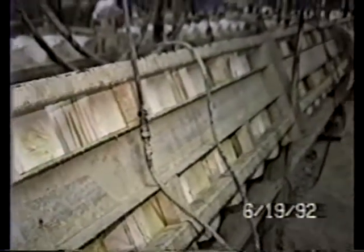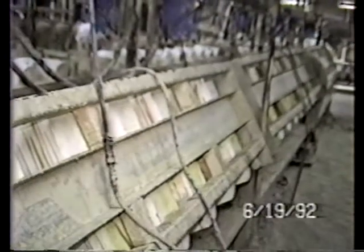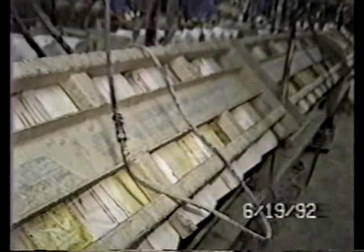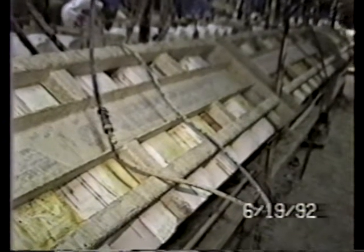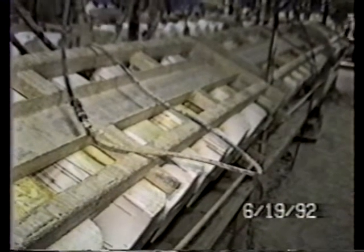turns. There we go. Now it'll tilt towards the inside. The reason it tilts gradually is so that the volume of liquid being discharged on the belt is maintained at a controllable rate. If they simply dumped it upside down, they might put too much slip, which might flood the conveyor belt or jam up some of the machinery. So it's indexed progressively when it's in the automatic cycle for control of the amount of discharge onto the belt.